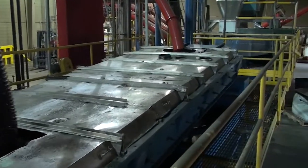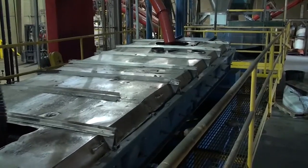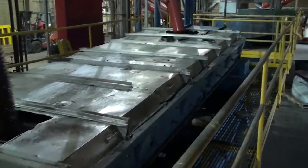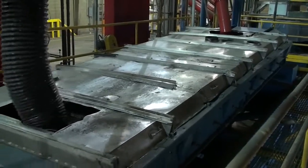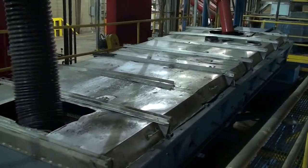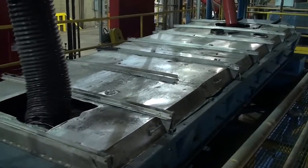The cracked rubber is now powder and is screened through a gyrating screen system that can have one or more varied size screen decks within. Each level of screen sieves for a different mesh size of rubber powders, as determined by the processor and the end use markets that they serve.